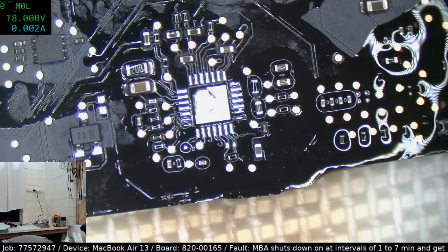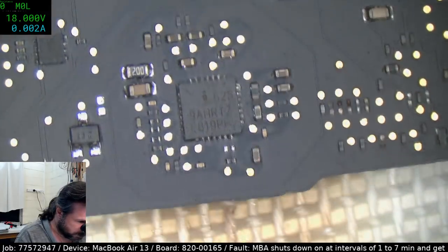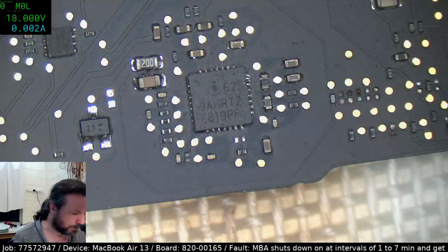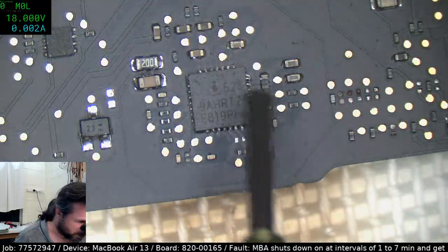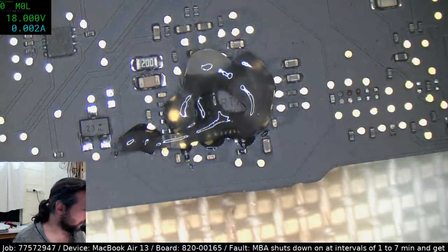Now, the touch disease was actually not that bad. Once you had a couple of runs with it, practices, it wasn't too bad. You could do it in about 30 minutes usually, because it was only one jumper that you had to do, and it was on the outside of the BGA array. You did need to have the right wire. That was definitely an essential thing. If you had big chunky wire, it would always be a nightmare because the wire would push up the chip and ruin everything else.